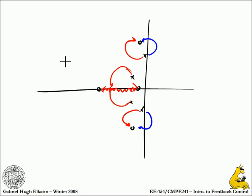Right? So the problem is this is an infinite search space. There is no method with a clear methodology that will tell you where to put down poles and zeros and what's a good idea, what's not, where to put them, how many of them to put, where to shove them, such that I get the response that I want. And that lack of systematicness can become problematic because you start, well, I'll put them here. No, I'll put them there. And you sort of just keep guessing. And guessing is a fairly poor way of finding a good solution.